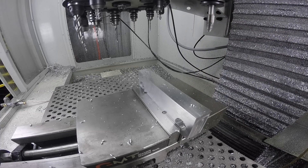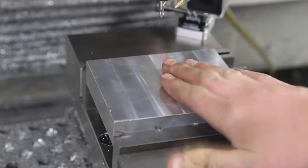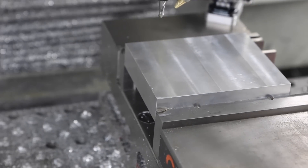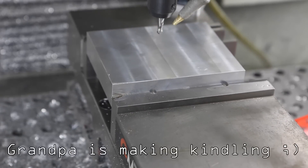I wasn't there to see that, but it looks good. Let's move on to the base plate. We're back to a one-inch plate, so we don't even need to use the height probe — we can just reset our zero to one. I've got tool 25 in here, done my sanity check, and we're ready to go.